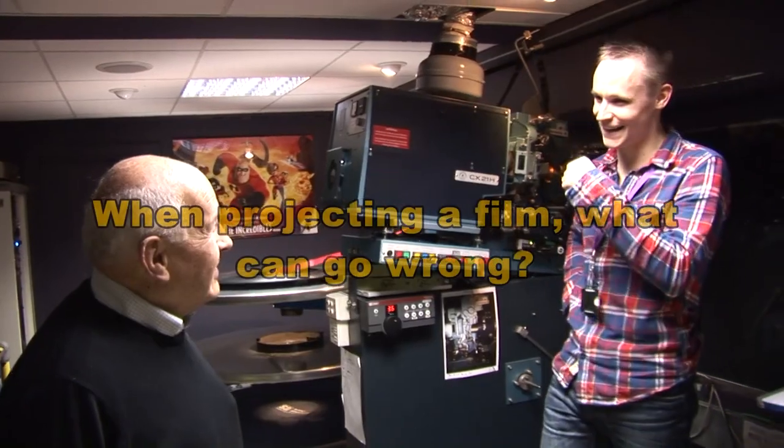These days, because we have so little film now, we don't really, but when we were two screens and 35mm, we would be there with our little spirit cleaning joints up. Taking cement joints out that were in the middle of a frame, because when a factory produces it, it puts the film stock together wherever. So it could be a nasty, great big joint down the middle of a frame, and you can just chop it out. It's just a detail thing.